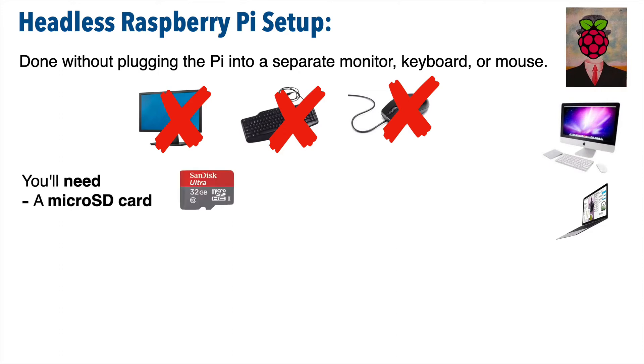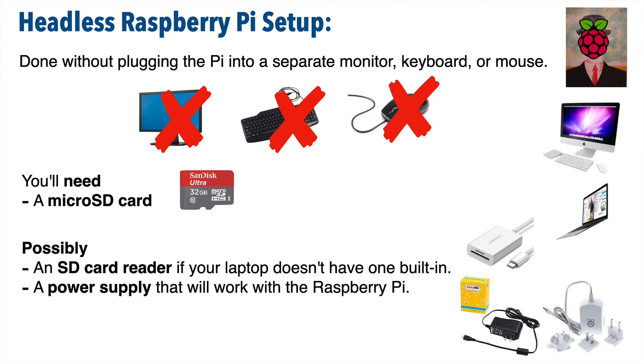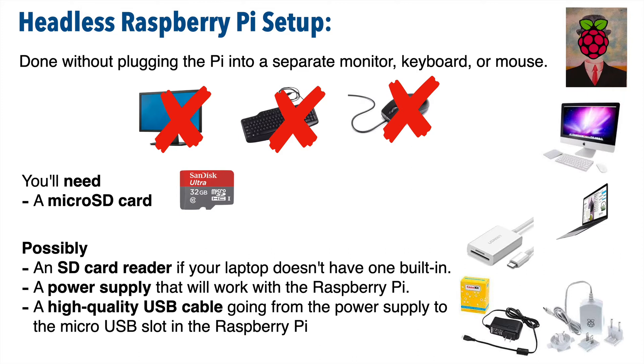You're also going to need a micro SD card — 8 gigs or more in size, and anything more than 32 gigs is overkill. You can buy one online for less than 10 bucks. If you've got a Mac, you'll probably need an SD card reader too, since modern Macs don't have a card reader slot — those are cheap online as well. You'll also need a power supply: Pi models before the Pi 4 can use a 2.5 amp 5 volt supply. Just search for a power supply for your Pi type.